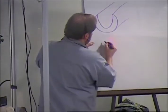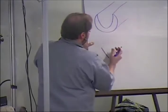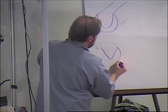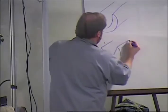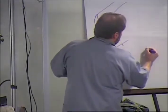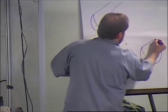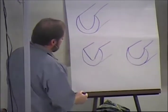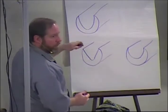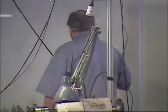That is going to be similar, but a very distinct V-shape or straight, flat wings with a curve at the bottom joining them. Something like that. And then the last one is the U-shape, which is exactly as it sounds. Going to be just like that. Okay? So the elliptical or parabolic and the V-shape are the two that you would want for the 40-40 grind. The U-shape is also good for what's called a bottom bowl gouge, and we'll get to that a little bit later.